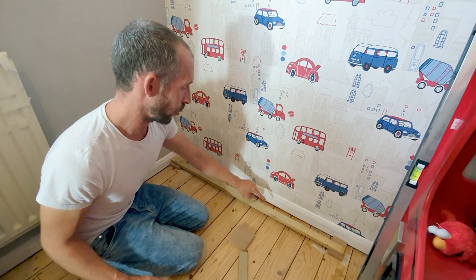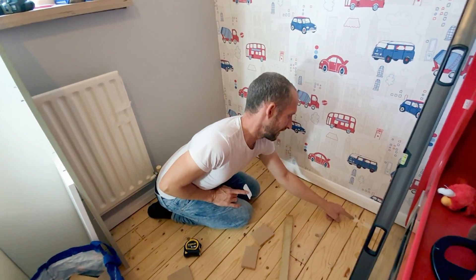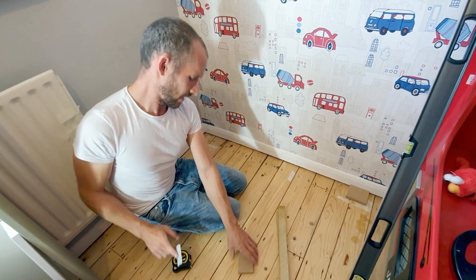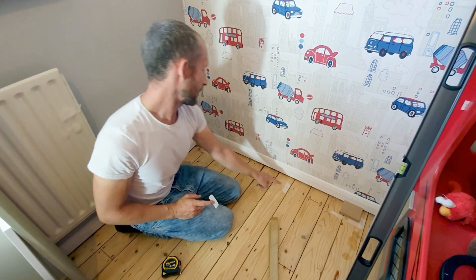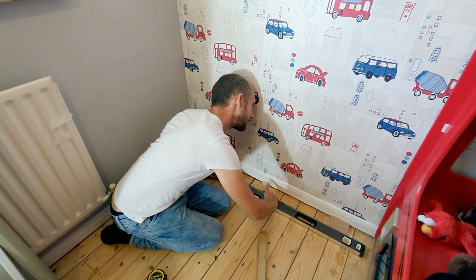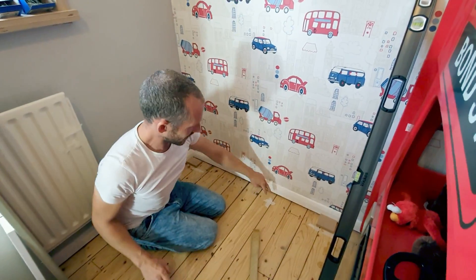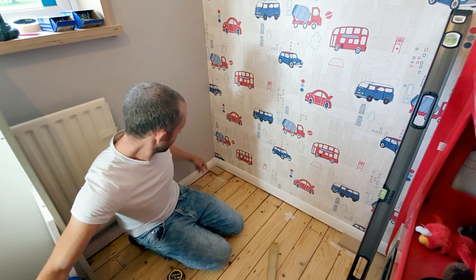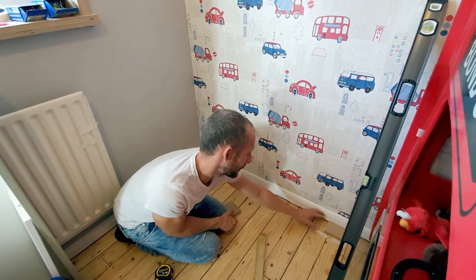Now I'll put a bit of masking tape here to carry the line on — we've got a little position for this middle one. We know that's the front of the bearer. All we need to do is get a level, put it up against the tape and packer — there we go. We've got the center of the back packer and the front edge of the packer. Let's get another 18 mil — that one goes roughly here; the tape marks the front. Now we know our positions.